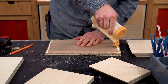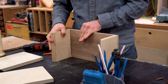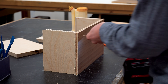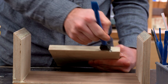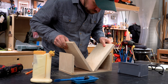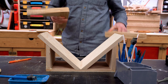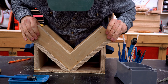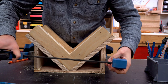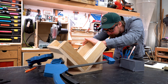From there it's a pretty straightforward glue-up. I add glue to the seams and screw the blocks into place. After adding glue to the two center panels I insert those, eyeballing the center mark, and then grab a couple of squares to make sure it's trued up. These are shop-made set-up squares from scrap plywood — make sure they're covered in packing tape so they don't stick to the jig. I add clamps and nail off the back edges to hold everything while the glue dries.